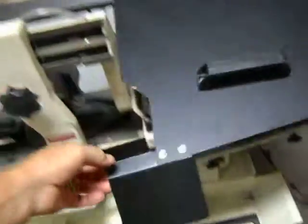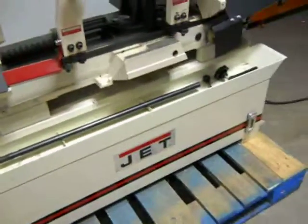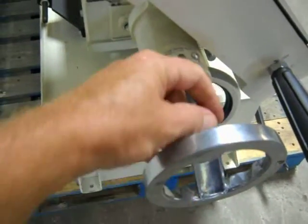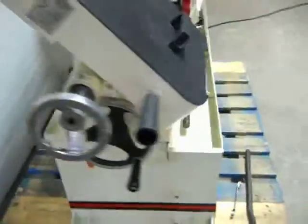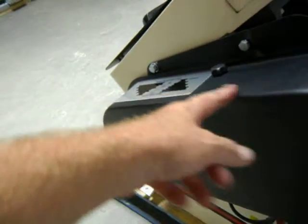Overall the machine is in very good condition and appears to be unused — I don't think anybody has cut metal with it. We had to replace a bolt right here where there was supposed to be a hex bolt. We reset the tensioner and made adjustments in the back, but we still couldn't get the blade to track. It may require a new blade. Those are the material stops over there. There is also a small dent in the pulley shroud right here, but that's nothing major.